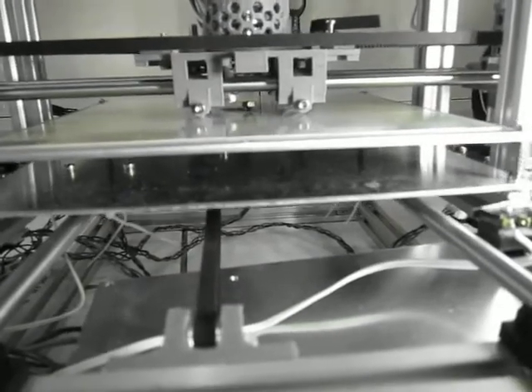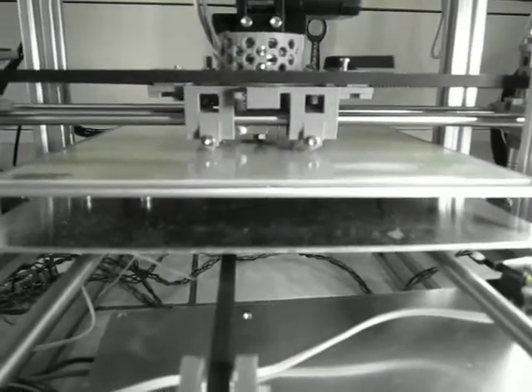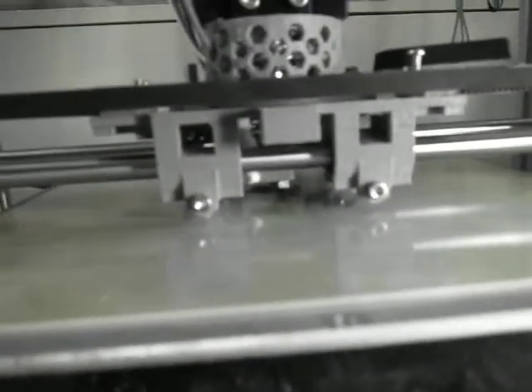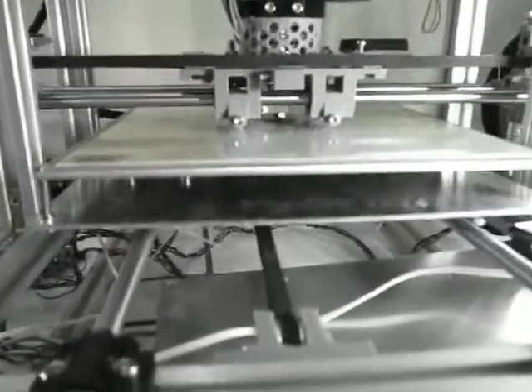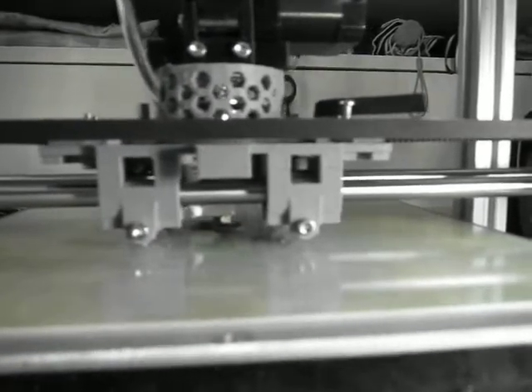It's 5,000 millimeters per second squared on the X and Y, and 9,000 on the Z. This is not the normal sound for a cheap and cheerful 3D printer. If you get one of these printers at normal sort of speeds it's like boring as hell, very sedate. It seems to be doing all right — it's not skipping. It's noisy.